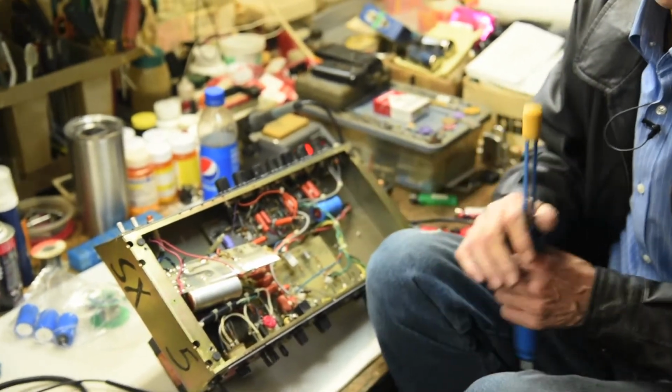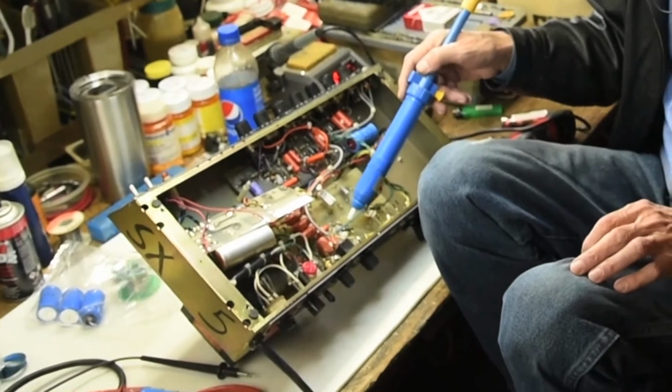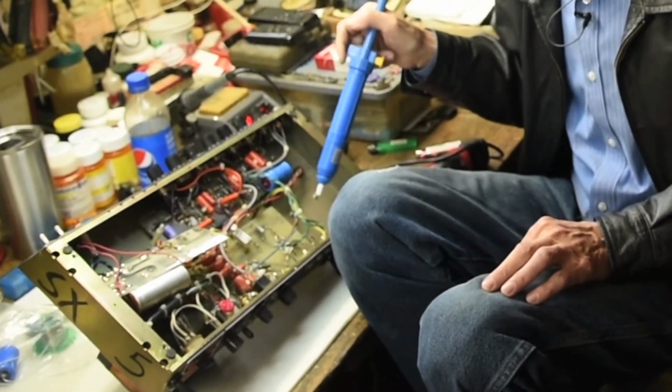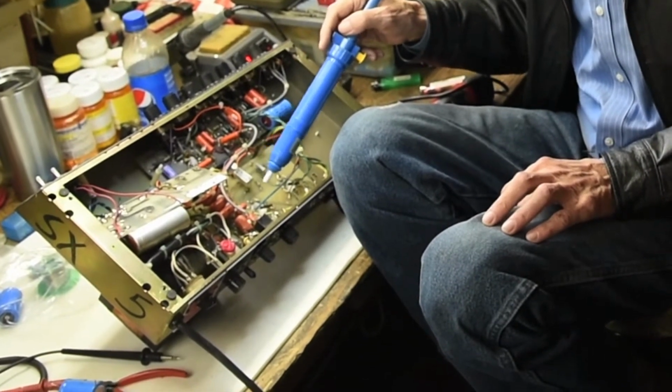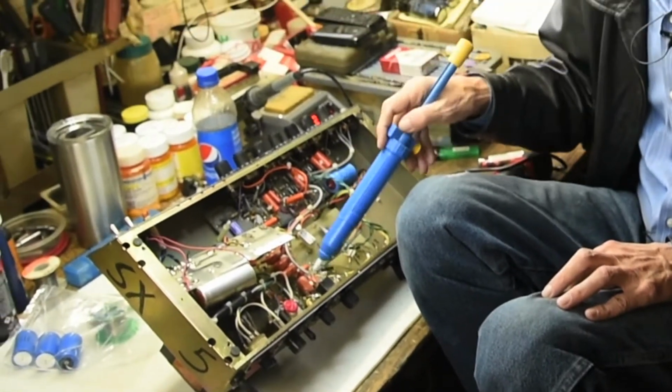Your output tube goes straight off the transformer, they're not dropped at all. It's DC, like everything else, but it's not dropped down any. It's not stepped down any. It's the same voltage that's coming out of the transformer. It's going straight to these two tubes.